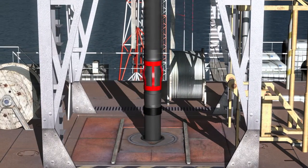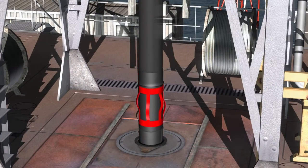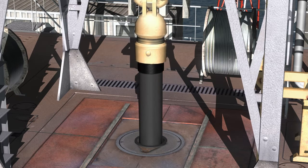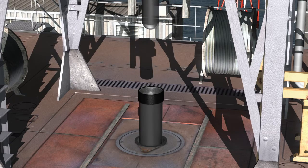The subbody acts as the carrier for the more intelligent cage of the centralizer. The centralizer must have the ability to compress completely to pass through extremely tight casing annuli, then expand to the predetermined hole size. This is common in deep water operations.